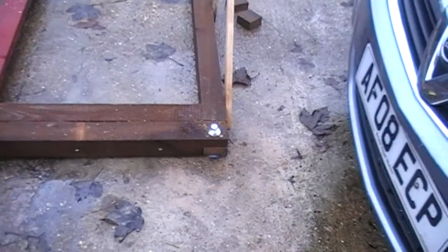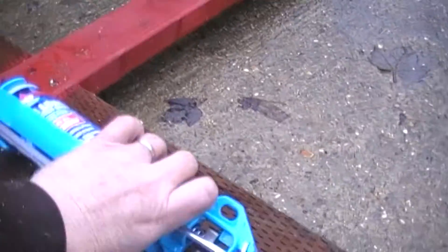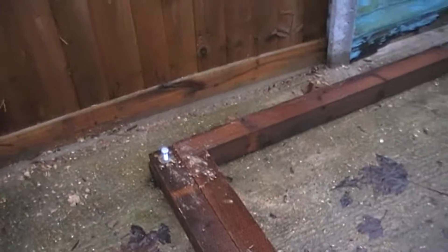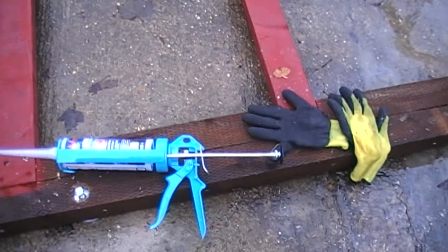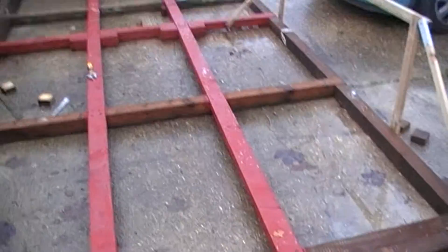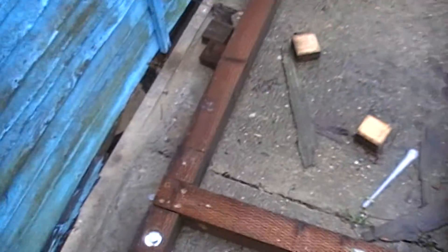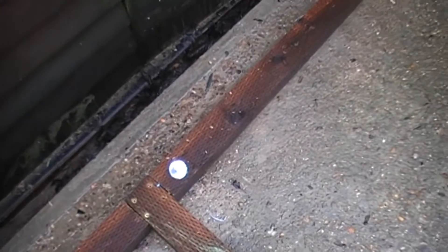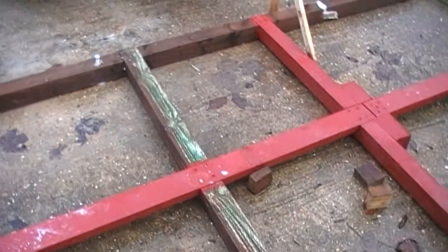All the holes now line up. I've had to make the bolts a bit looser — that one's not particularly loose, but it'll wiggle a bit now so I can get it in and it all drops into the holes. The next stage is to get the anchor, inject the epoxy, and I've then got 10 minutes to drop the frame in, so it has to be quite quick. We've now filled the holes with epoxy and dropped the sockets into the holes. It might still need some levelling discs, but once these things are set rock hard, we can undo the bolts again, and hey presto — we have the anchors set in the right places. Well, that's the idea.